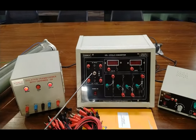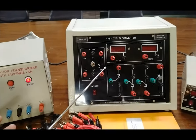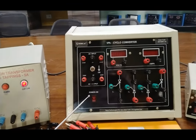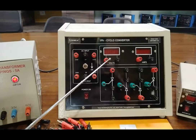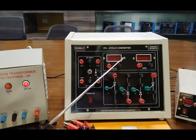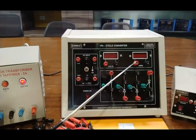This is the on-off switch for the MCB, and the complete circuit is protected from overload and short circuit. This is the power on-off switch to provide gate pulses continuously to the circuit. There are voltmeters which read up to 0 to 300 volts and an ammeter of up to 10 ampere rating in alternating current.